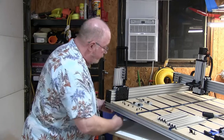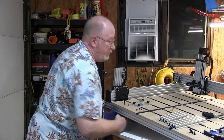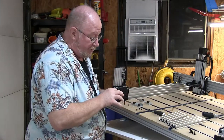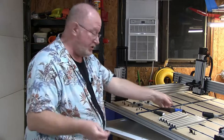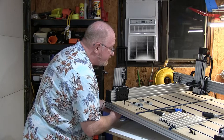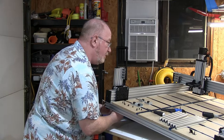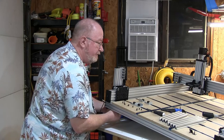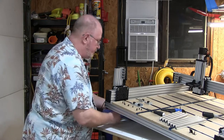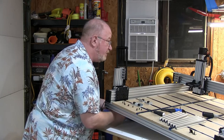there. So because you have some space here, you can actually get a ball driver. Well, you could. That one's not going to work so good. So what you need is a 3mm Allen head wrench, and you can get on that screw on the bottom, which was the one that was almost having me take everything apart. You can't see it because I'm doing this all by feel and we're not good enough with the camera yet. And you don't have to take it apart, you just have to loosen it. It just has to be rattle loose. That's the important thing, you don't really want to take it apart, you just want to loosen it.